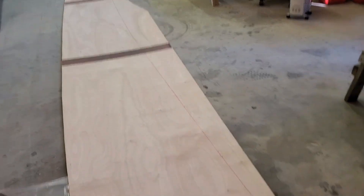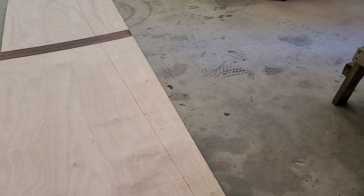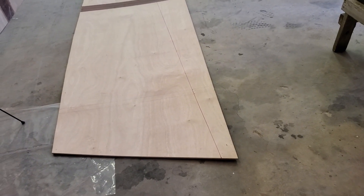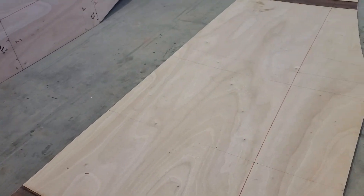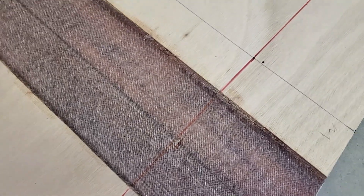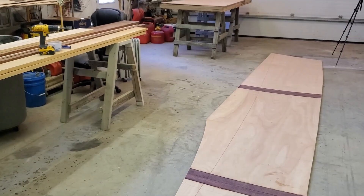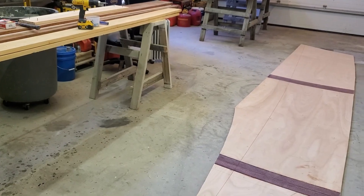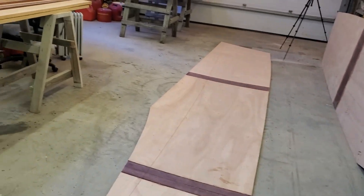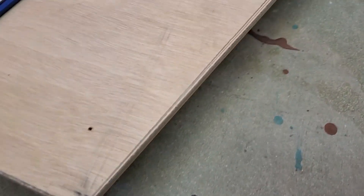On the starboard exterior hull, I've drawn the shear line out in red — the shear strake. It strikes me as being flat up in the forward sections; from here it looks like a curve, but get down at eye level and it looks flat. I played with it a bit by eye, especially back at station eight — ended up a little below that actual mark because it just wasn't flowing. But it looks pretty good. When I go to fasten that trim, that gunnel, I'll work off that line and adjust as needed. This is the fourth time I've drawn this line and I've had that same doubt about the forward section every time.